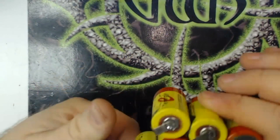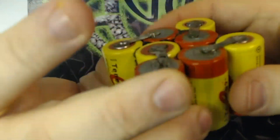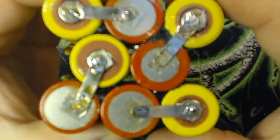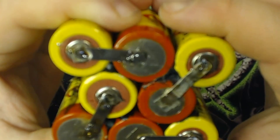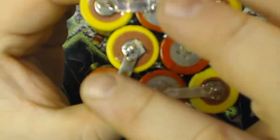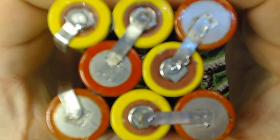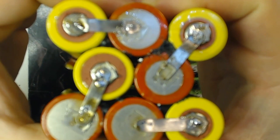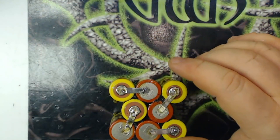What I'm going to do now — I've actually already done it to this side — I'm going to take a little bit of denatured alcohol and clean up all the brown residue you can see all over the place. That's the flux, the liquid flux that we used. Denatured alcohol will clean that sticky rosin off really well. I've already done it to this side, and you can tell on camera it looks a lot cleaner — doesn't have all the brown spots all over it. So I'm just going to take a little paper towel...